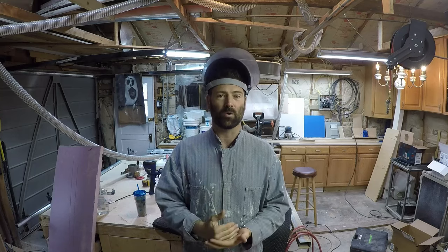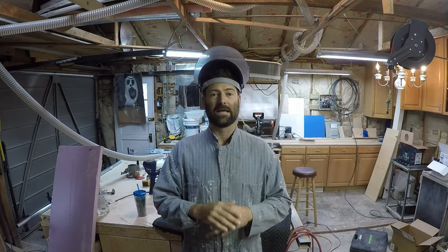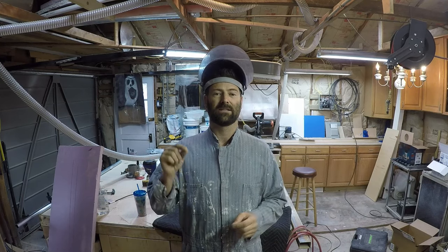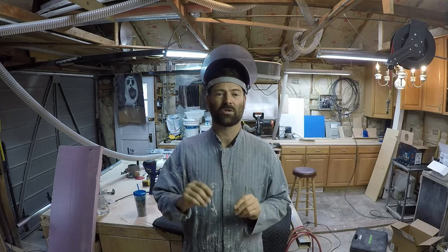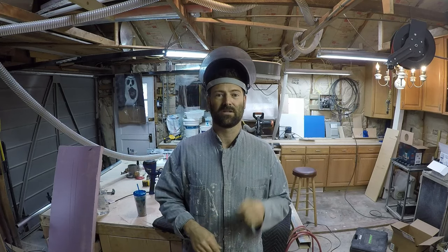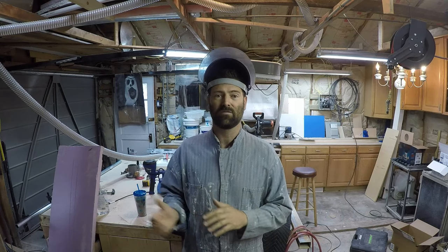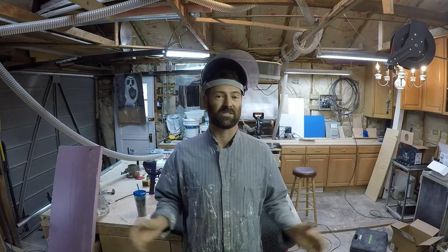But like I said in the first video, the key is getting rid of the material the mold is on, and stopping the water leak, and not repairing it until the moisture content of everything has dried. And that's where this video starts, with the moisture content of the remaining 2x4s. There were three that I just completely removed because they were just nasty.